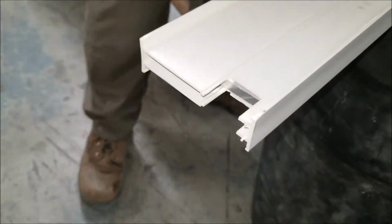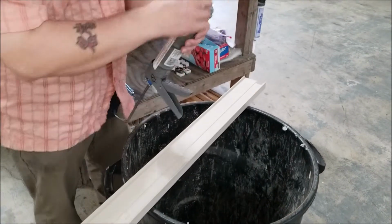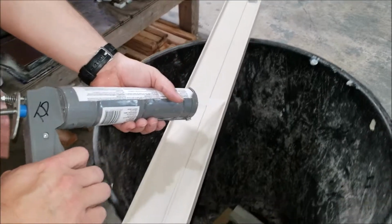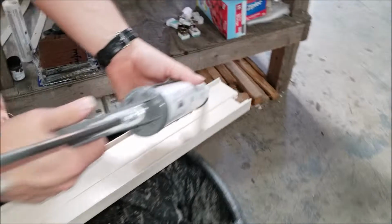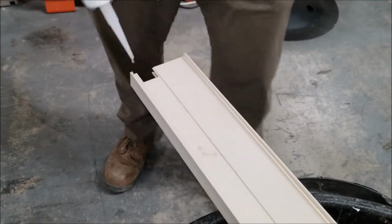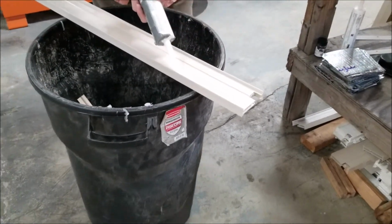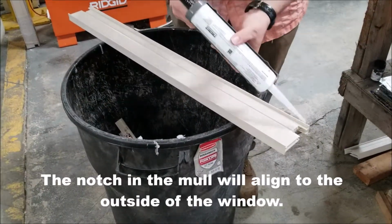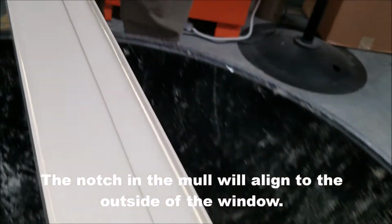Now, what you will do is take the silicone. This particular brand has an opening already in it, and you want to run a continuous bead of silicone, about 1/8 of an inch. You don't have to go crazy with it. It's actually good to have a small amount because it doesn't seep out so much and it will still adhere. Remember, you're only as strong as the points you're meeting together with, so extra silicone just means extra mess. And that's that.